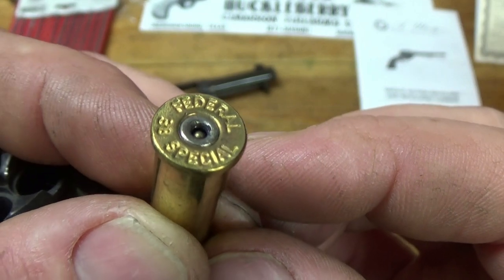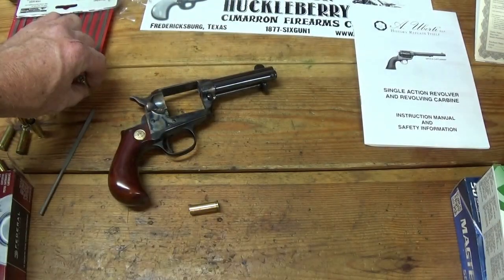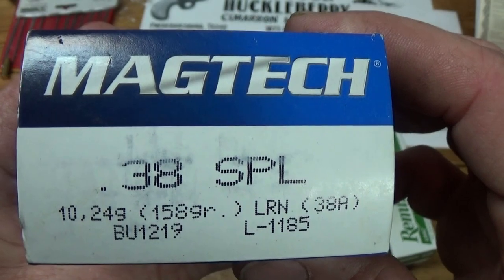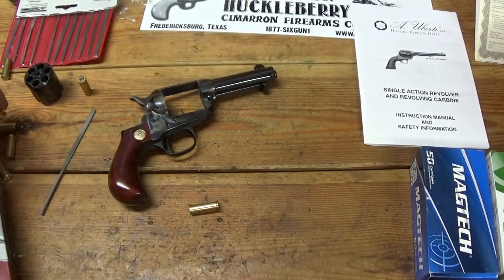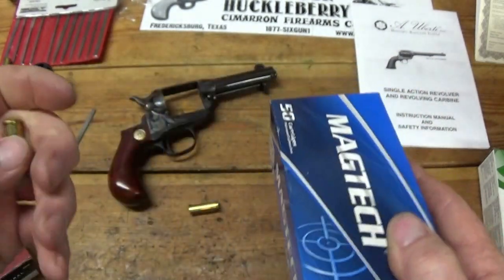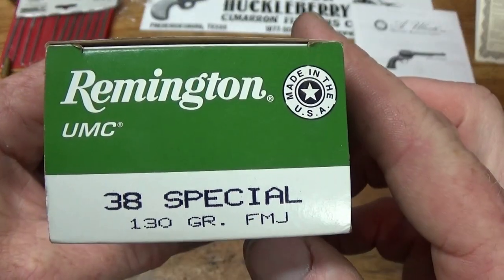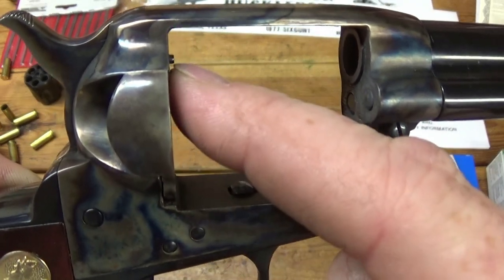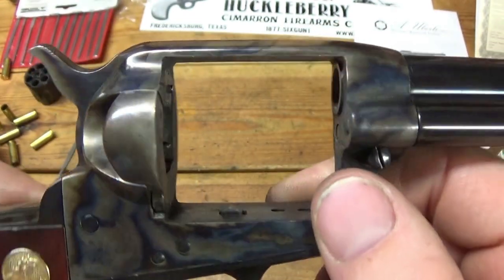Here's my second issue. That firing pin is really doing the trick there. I used three types of ammunition thus far: the Federal, Magtech, and the Remington. It really tears those primers up on the Federals. Not so much the Magtech — every once in a while it will puncture the primer on the Magtech, but nothing like it does with the Federal. I don't notice it on the Remington brass. I did file just a hair off the firing pin and it's still doing it. So I don't know if I should file any more off that firing pin or just leave it the way it is. Comment please and let me know what you would do. So that's the second issue.